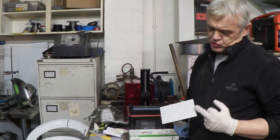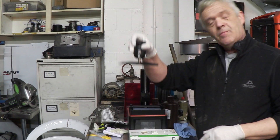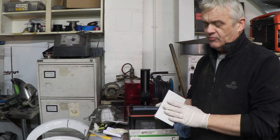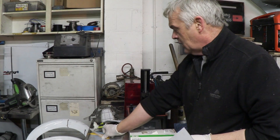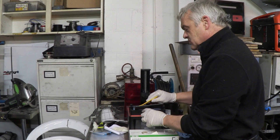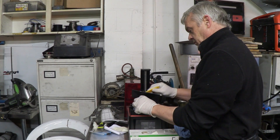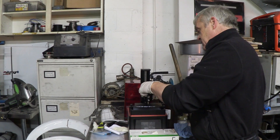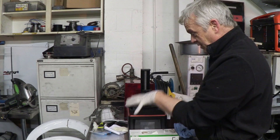Now this build plate foot on the Mars 2 Pro is a bit of ground aluminium, and there are lots of little hills and valleys in there. If you just stick it straight in, the air trapped in those hills and valleys means it won't be in the best contact with the FEP sheet, giving it less chance of sticking. So wipe a bit of resin over the plate to ensure a good coating of all those little hills and valleys without trapping air. Then the air won't get trapped because there's already resin in there.